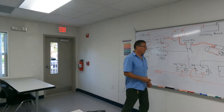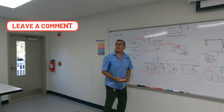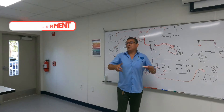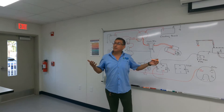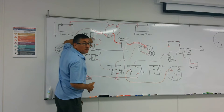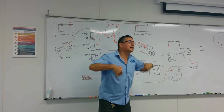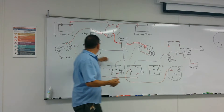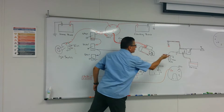Orange cable. What is the output of the alternator when it is running? 12 volts — if the engine is 12 volts, it's 13.7, 14.2. You remember? Why do I need to wait with this button pressed 10 seconds? Because I need to wait a little until the alternator produces power. When the alternator is producing power, I remove this finger and this current enters the relay and the relay continues running.